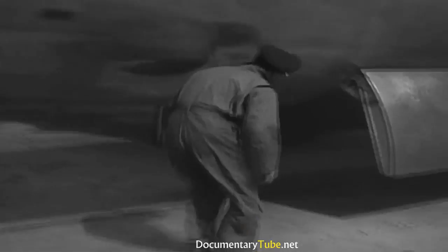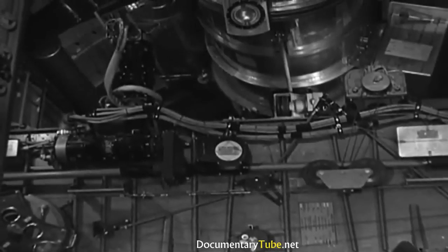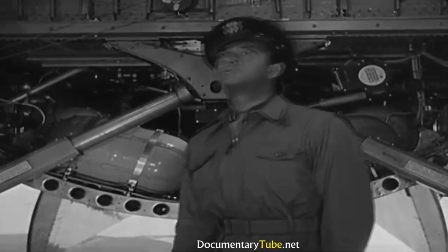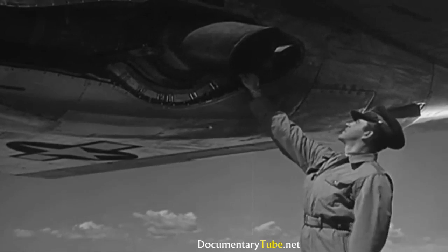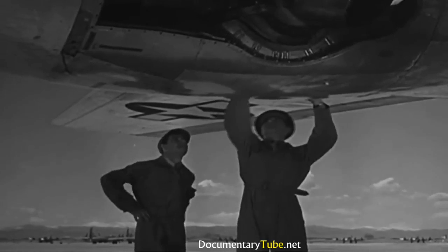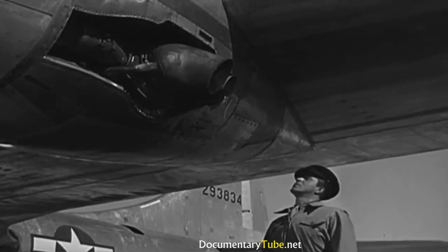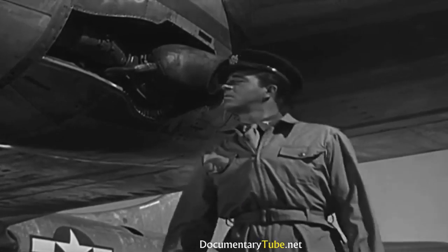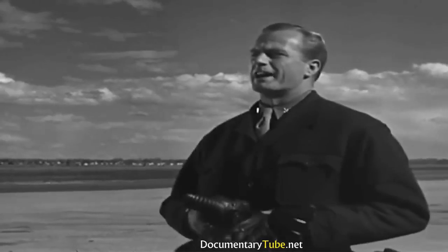Oh, but one sure thing. I better take a look at the equipment in the bomb bay. Okay, portable emergency motor in flap operating position, right where it belongs. Turbo superchargers are next. Test hood for security. Take a look at the wastegate axle. Should have plenty of play, and no ballooning in the nozzle box. This is the last of the turbos. It's okay, too. Everything else seems to be in good shape. What's next? Oh, yeah, fire extinguisher in the right place. All right, fall in for inspection.